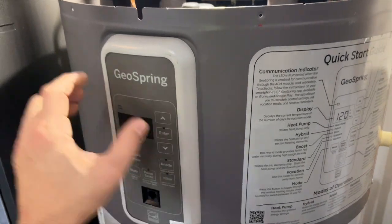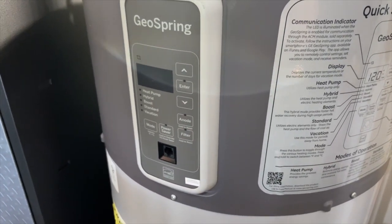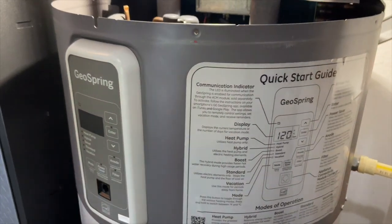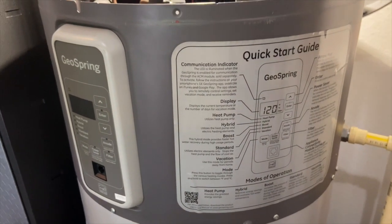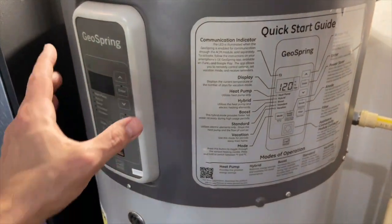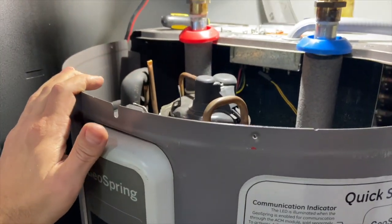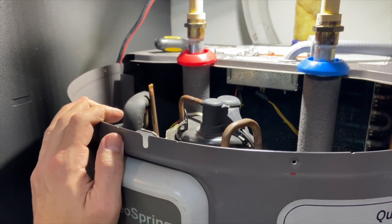Now if you've been following along, you'll notice that I did not reconnect this little wire. The reason is a couple of things. For this water heater, there is a specific part number with that little nut on top where you can attach the lead and get an anode reading for how much life is left on your anode rod — and GE has discontinued that part. There's a replacement part; I think it's like $140, and it's only available from one online retailer. The rod I just bought from Home Depot was $40. All I had to do was cut it down, and all that does is discontinue this feature on the water heater, which means you'll have to pull it out every couple of years and check it — which is fine by me. I'll do that to save the extra $100. You may wish to buy the other anode rod yourself — you can do that.